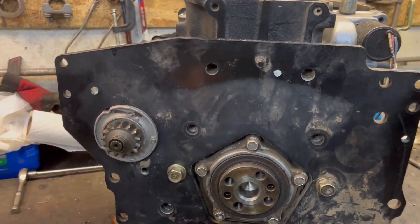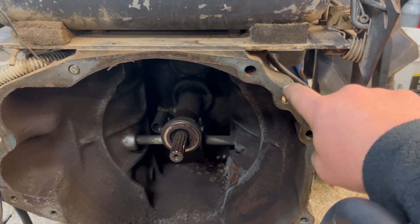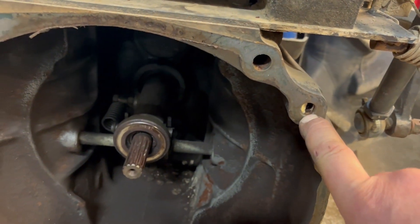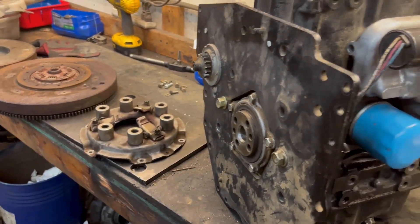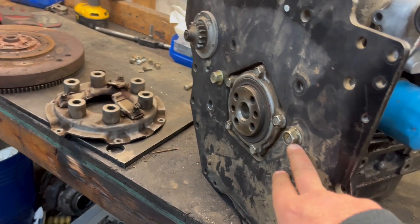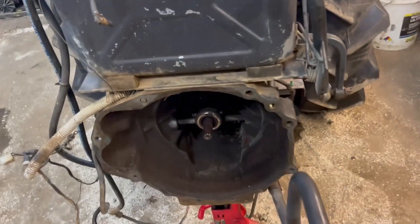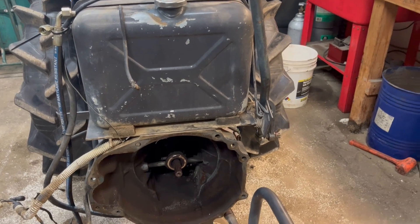So if the starter has to be on the left, that means on the machine the starter would have to be over here, and I would have to cut away at this bell housing — maybe not very deep, maybe just about that deep. We'd lose a locating pin right there. I would also have to fabricate a new plate because this plate does not interface with that bell housing — it's the wrong plate. And I would have to be very precise with all the holes to make sure that the output shaft of the engine was perfectly concentric with the input shaft of the transmission. That takes a level of patience I don't think I have.